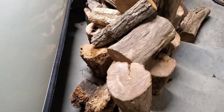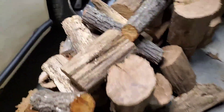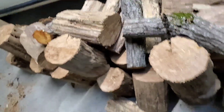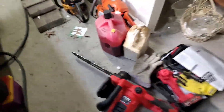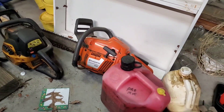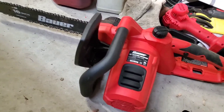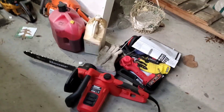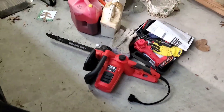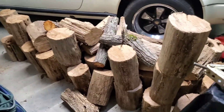So that very first tree that I dragged down here — I cut it up using a chainsaw and there are about 45 pieces, so 45 cuts with a chainsaw. Of course you have to keep moving the log and jacking it up because it needs to be off the ground to cut. I have a Husqvarna and a Poulan — the Husqvarna is great, but these gas engine ones are noisy as all get out and kind of finicky. So I like this electric one I got at Harbor Freight for about 75 bucks. It's quiet, surprisingly powerful, and just so much easier. That's why I drag the log down here where there's electricity.